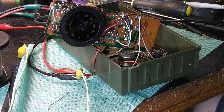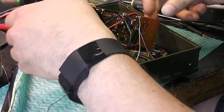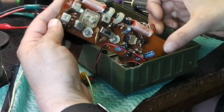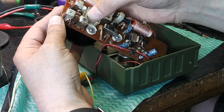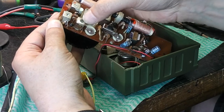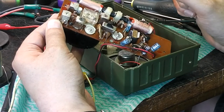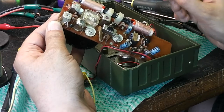I find it quite interesting that when I turn my fluorescent light on, it's quite sensitive to the electrical noise. Yeah, I can only hear radio stations very faintly. Very suspicious of this. I think that must be the detector IF. There's a diode. Nice and sensitive there. That's topped right at the top of the can. You know, I can't help thinking someone's been at this.